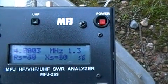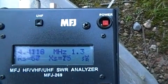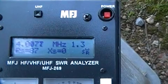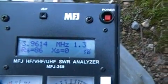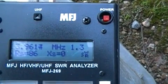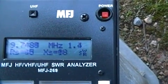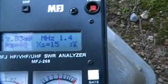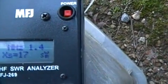You can see there's very little reactance. When you have no reactance, that's a good thing, because that means there's nothing to reflect back — that's what causes high SWR: reactance in your antenna system. Now going to the next band, I've just changed the band switch to the 10 to 27 MHz range.